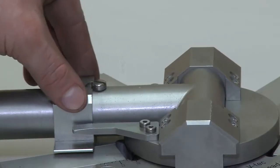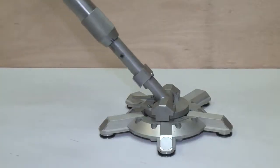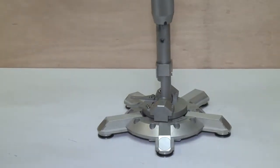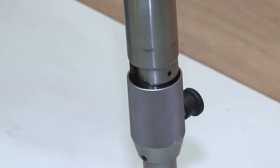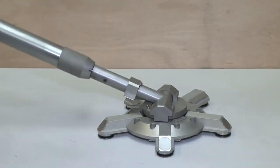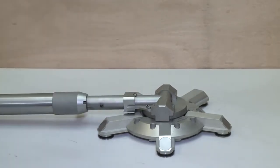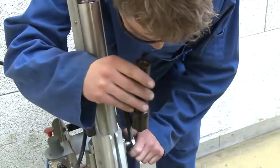The flexible connection between the Orbit arm and drive head makes it easy to switch from the vertical position, used for gate, parallel slide and check valves, to the horizontal position, used for globe and safety valves. The arm construction gives sufficient movement to prevent any influence on the seat angle.